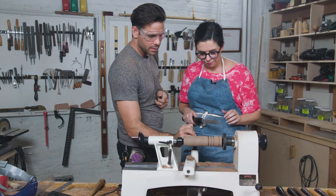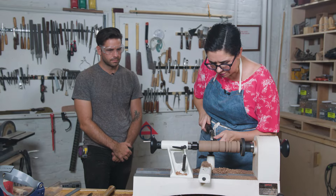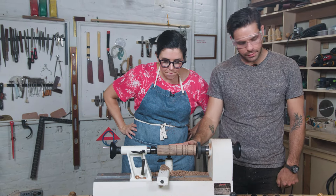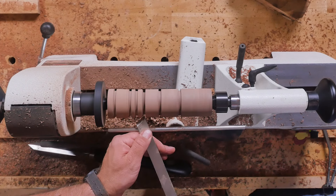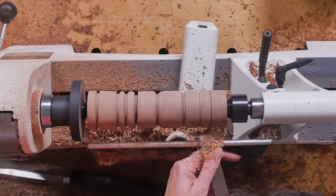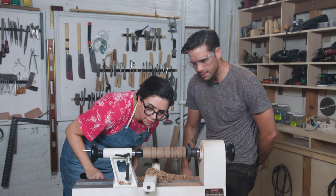So you've got those three marks. I'm going to give you another mark here, and another mark here. I'm really feeling it — this is fun! So now I'm going to show you how to just round these over. I'm going to take this skew chisel and just touch it to the inside, like that, and then sweep it across, like that. That looks excellent. It's smooth in there — you can see the profile is smooth. It's really, really good.